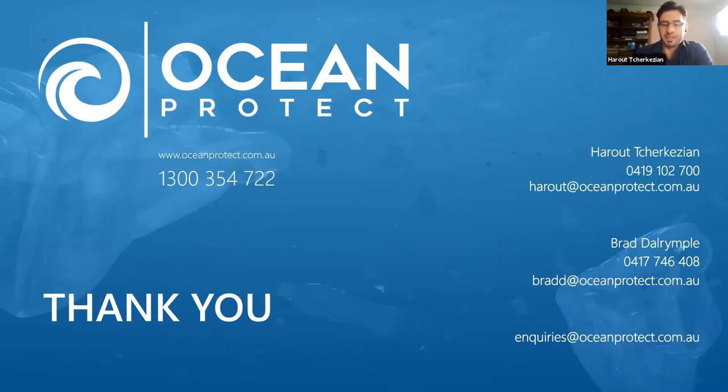In terms of replacement period, I mentioned with StormFilter, their expectation could be anywhere from 1 to 3 years, if the systems are designed properly. We're designing these in MUSIC, and often we'll have a MUSIC model we're looking at helping an engineer, and it might say in MUSIC that, for example, you only need 3 StormFilter cartridges, whatever size it might be. But we look at the mass load, we think about the application that the system's being used in, and we might come back to the engineer and say, listen, you might actually need a couple more for these reasons. And yes, it might be a little bit more costly upfront, but it's going to work better long term. It's going to give the asset a better outcome.